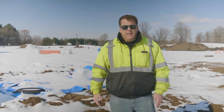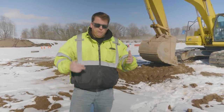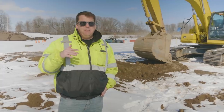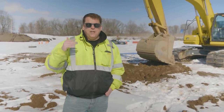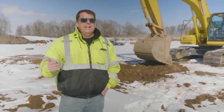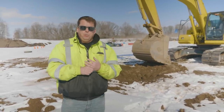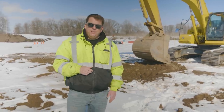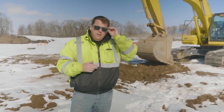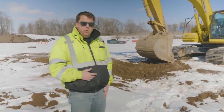I'm also going to show an area that has not been tarped. I've already started over here where I've gotten down probably about a foot. Now, frost levels — we are in Minnesota. Today's sunny and beautiful, it's probably around 20 degrees. We've come off an extremely cold week: it was negative nine air temperature, wind chill of negative 28 earlier this week. So we've had a really hard freeze. Typically about six feet is the frost line in Minnesota in a normal winter, say five to six feet, but it can be deeper or shallower.